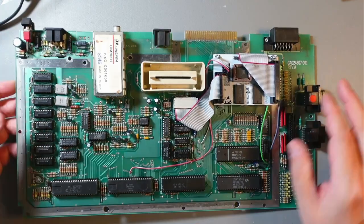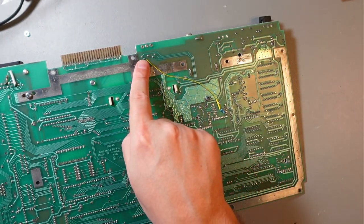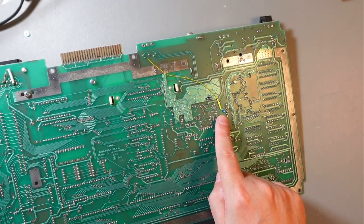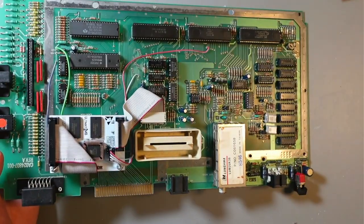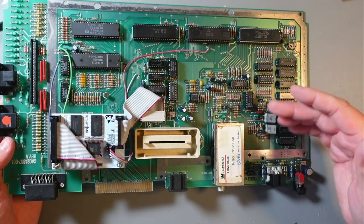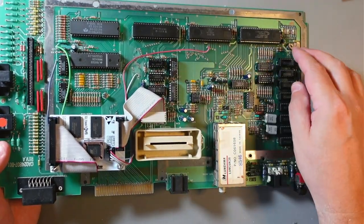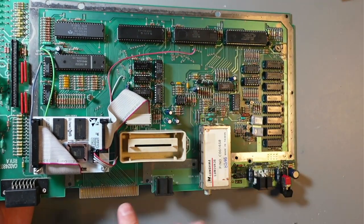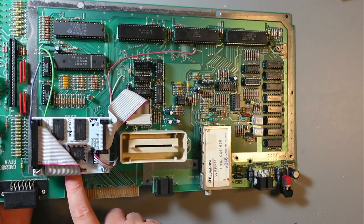So that's done. Oh, by the way, also, I forgot. This is the S-Video, or Chroma, I believe. It's Chroma, yeah. So from here to here with a 100 ohm resistor. And again, these points for the Ultimate 1 MB that I'm using, I'll put in the description, that photograph. Again, that photo was from one of my first 800XLs, and it was a later revision where these holes were kind of empty. In this one, as you can see, this is an early revision because everything is socketed here, which, by the way, made this upgrade a lot easier because I didn't have to desolder the MMU and the OS.